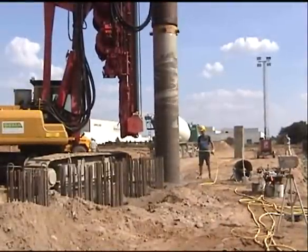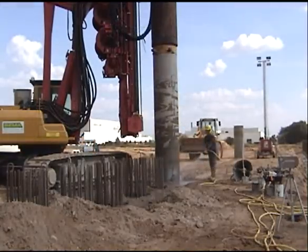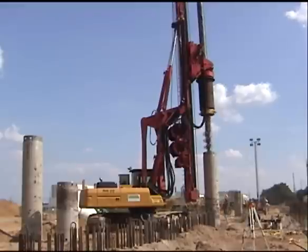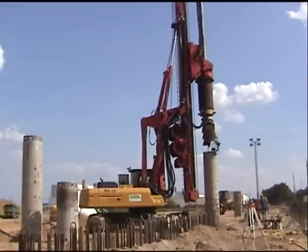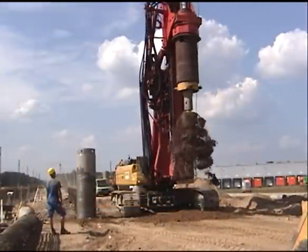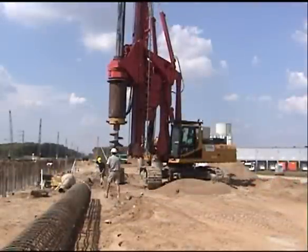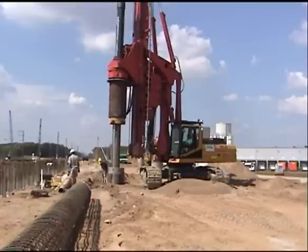ABI's success has led to an expansion in the form of the acquisition of DelMAG in January 2000, a company manufacturing diesel hammers and hydraulic drilling rigs. DelMAG is now able to offer drilling rigs up to 180,000 foot-pounds of torque, with pullbacks of 92,500 pounds for larger diameters or very hard ground conditions. With interlockable Kelly bars, reinforced design, and heavy weight, they are able to transmit crowd forces of up to 44,000 pounds to the tools and drill batter piles up to 22 degrees.